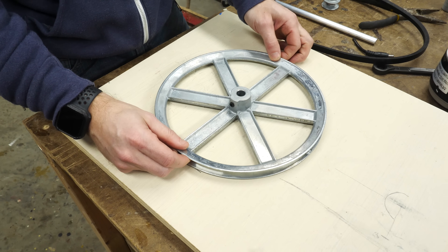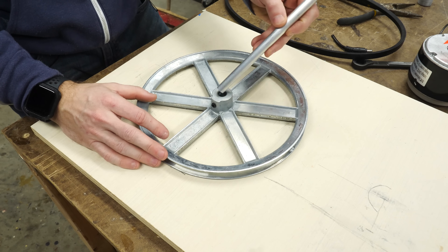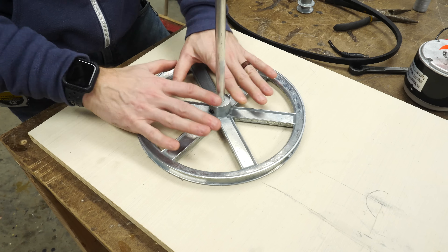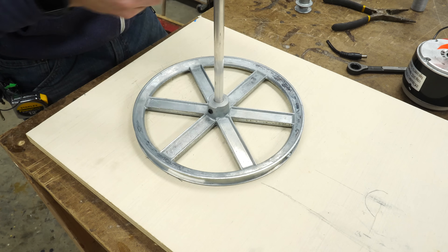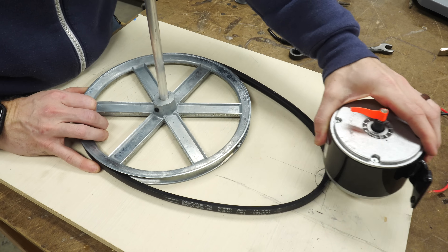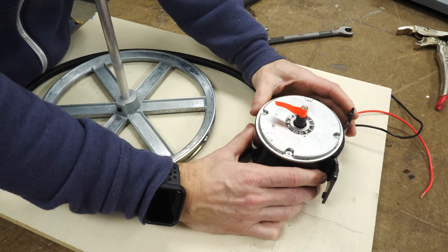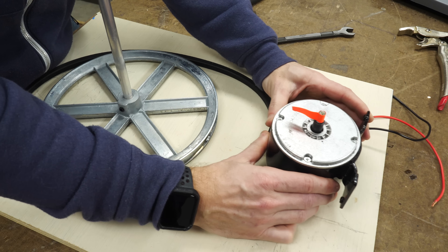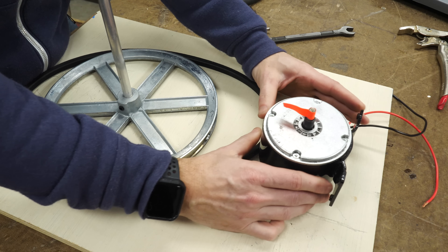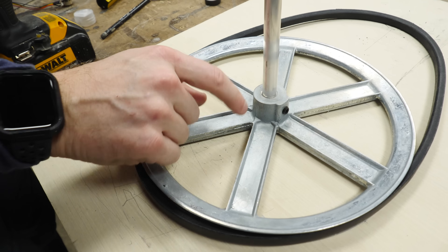The flywheel is gonna go down here, and that's gonna connect to the surface called the bat — where you put the clay — through this shaft. This whole thing is gonna be driven by a belt. A belt needs to be tight to the motor, and usually you would do that with an idler wheel, but instead we're gonna mount the motor on a plate that can shift forward and backward just a little bit, and that'll help us adjust the tension on the belt. To get this mounted, I have to run this shaft through this piece of plywood, and to do that we're gonna put in a bearing. It's one and an eighth of an inch on the outside, so we're gonna use a Forstner bit to make a hole to press it into.